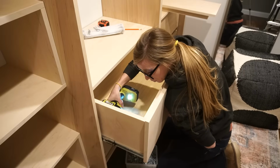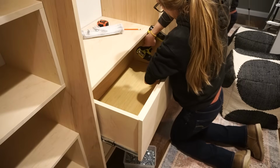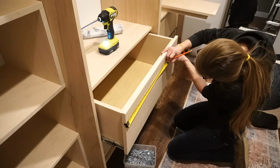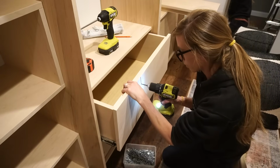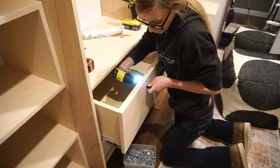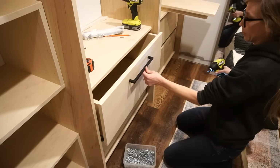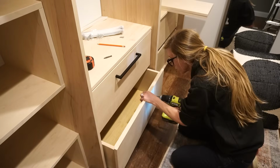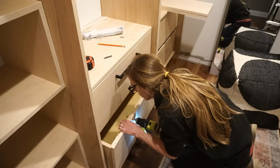I edge banded these drawer fronts, brought them inside, and screwed them in through the front of each drawer box, leaving an 1/8 inch gap on all sides. Now again, I have a complete guide on how to figure out your drawer front measurements that I will link in the description. I went ahead and added the drawer pulls here too, because if I didn't add these now, I wouldn't be able to open the drawers again since they are inset.